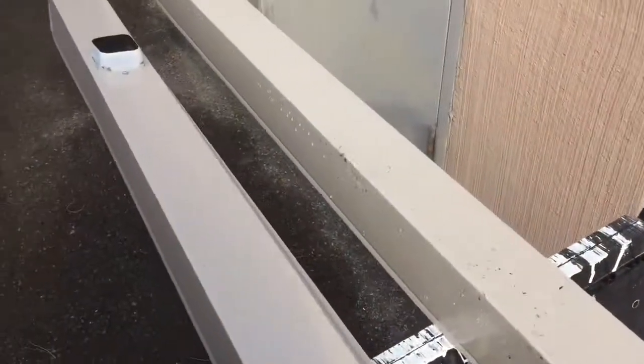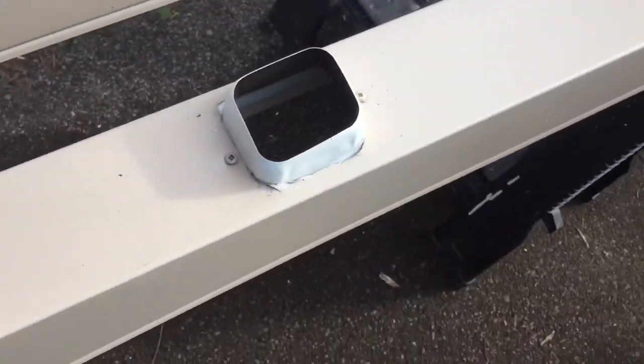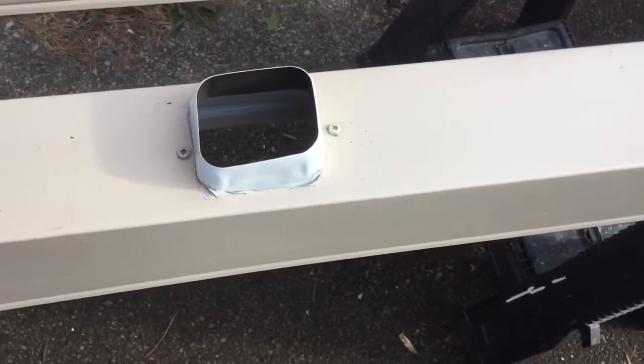And when it's done, it'll look something like that. We'll pop the drop through, and that gives us something to screw, nice and solid to screw our downspout to. And I like using them. They take a little bit longer. You got to use some more tools, but I like the final result better. Okay, so we slid the drops up through from the back side, and 2 screws will hold it in place. Simple as that.